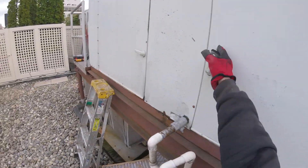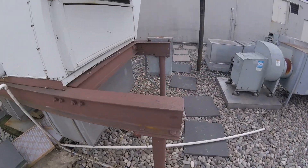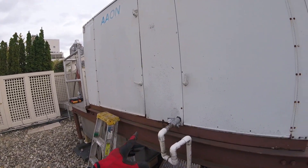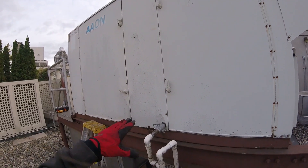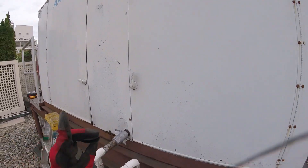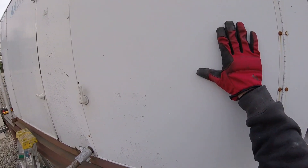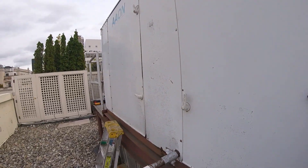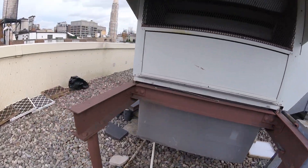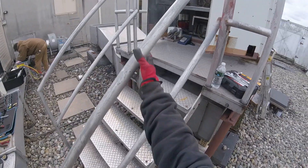I'm just going to replace the filters because this coil is filthy and these are the old disgusting filters. The fan belt tore off because it was in a bad position — I adjusted it straight. We replaced the belt. It tore up all those wires — we traced out each wire color for color. Then we wired the safety controls. Then we ran new wires to the damper motor, and the damper motor gets energized when the evaporator fan turns on. I found this video interesting and helpful. Please drop a like, comment, and subscribe. Catch you guys next time.